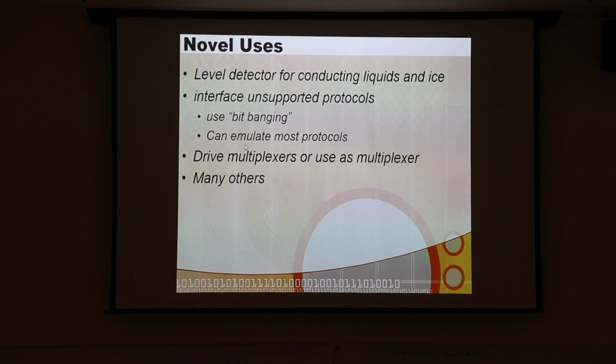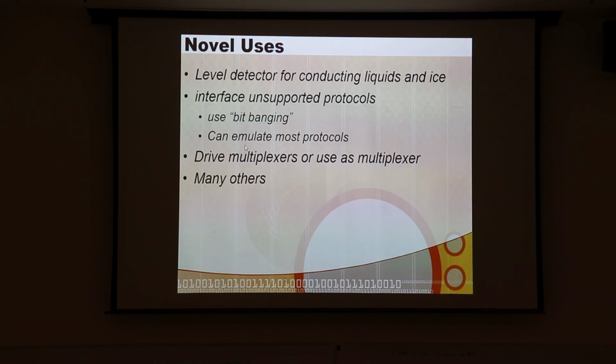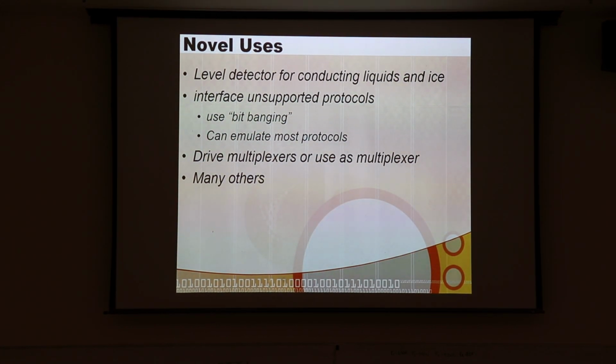How powerful is our chip? You mean in terms of what? The world, the industry? Well, so it's definitely a low-level chip. It's an 8-bit chip. The clock's pretty fast. The instruction cycle's not bad. And it's got 8K of flash and 1K of RAM. So it has a fairly good capability. There are a lot of chips with less memory. You can buy micros with 128 bytes of program memory, a little bitty program memory, because maybe you don't need that much.